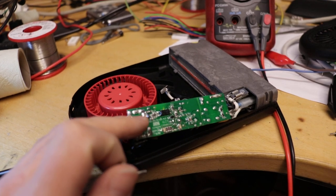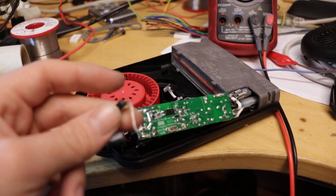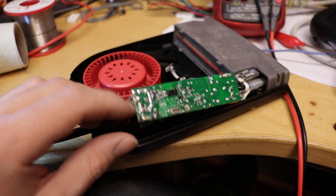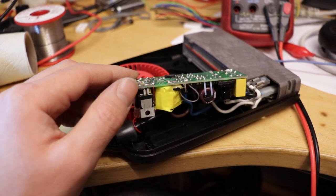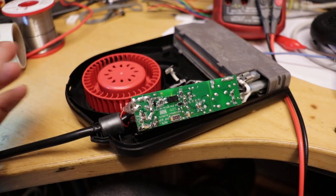The Post Plus seems to be handling it fine, the heater as well, so hopefully when you have one that does this, you just swap the SR5010 diode for something a bit fatter. I used a 20 amp, 100 volt SMPS rectifier Schottky diode. It's running a lot cooler and working just fine. So there you go.